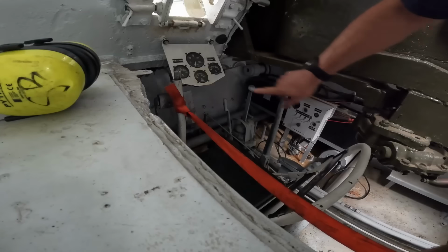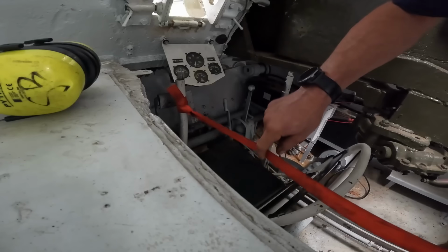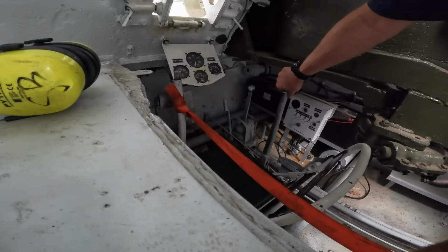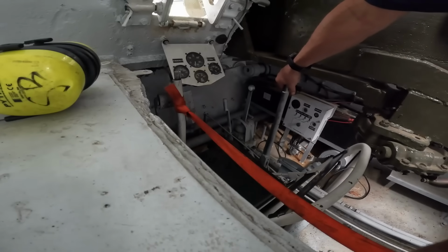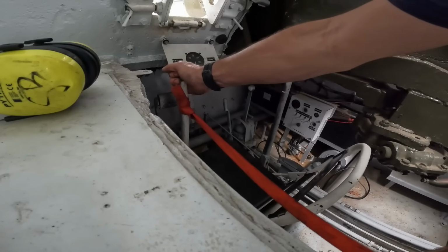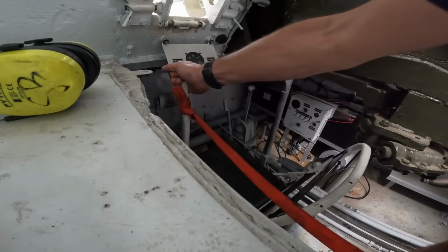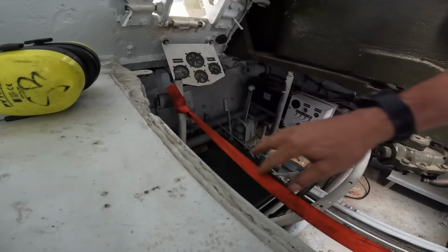You can see that the two levers pull back in a different position, and I have to have a strap on this one to hold it back, whereas the right hand side tiller is actually locked in place here, and with it locked in place it will actually turn by itself without having to put any additional effort on it, where with the left hand one, even if you're swinging off it like a gorilla, the thing still won't turn left because the action's not translating into leverage down the back of the tank.